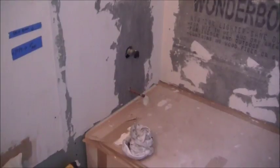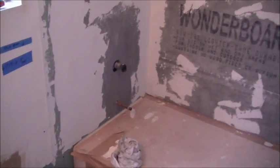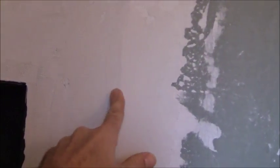Alright, the last time you saw me, I had done a first coat, and that first coat was really loose. Here's a second coat. The consistency you want is peanut butter, really. So here, this is the second coat on this wall and on this back wall. And I ran out of material, and this is what the first coat looked like on the first wall, if that shows up at all. You can still see the mesh fiberglass, like around the niche, and here, there's a little bit of a second coat right there, so you can kind of see the difference between here and here.